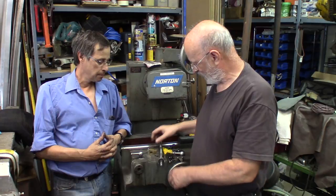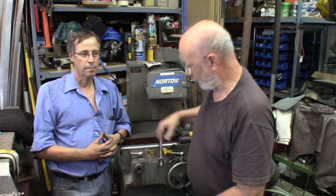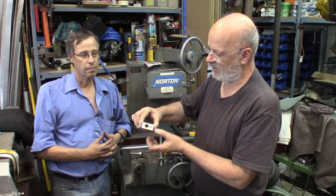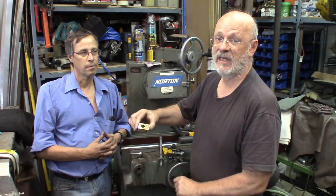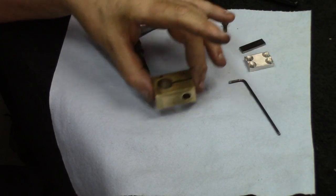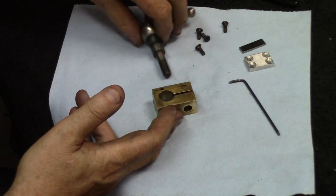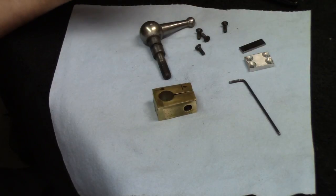The first issue was the braking device for the wheel that turns the carriage right and left. I'll show close-ups of that, but this clamping device was pretty worn — not the right diameter anymore. It's been machined, but the brake for the x-axis shaft was kind of worn. It wasn't one piece, and whenever you turned the handle to make it tight, it would just go tight but there wasn't enough meat there to rub on the shaft and make a decent brake.